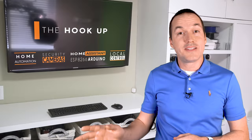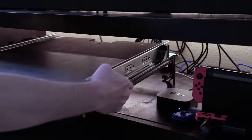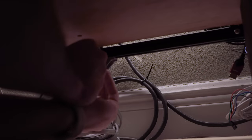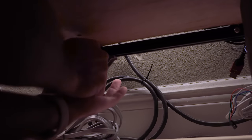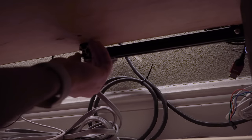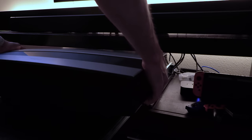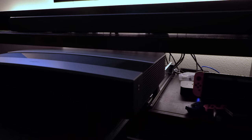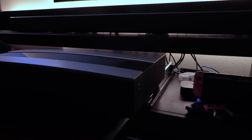At this point, if you want to check clearances and test fit everything, just slide your shelf over the back of your existing furniture and move the bottom attachment arms up until the rubber weather seal is compressed before tightening them back down. Your projector and shelf should easily slide in and out by just manually turning the lead screw. If it's binding up at any point, check your alignments and clearances. If all is well, it's time to get that motor moving.